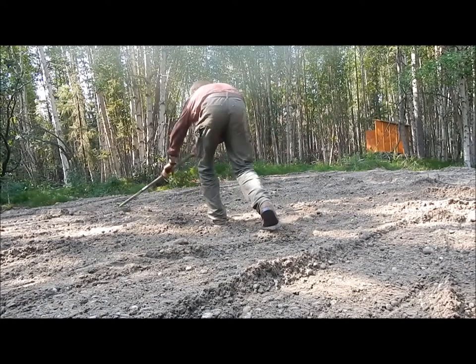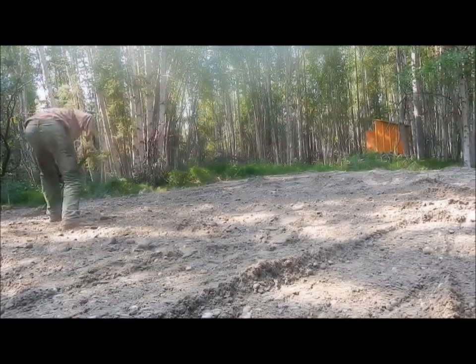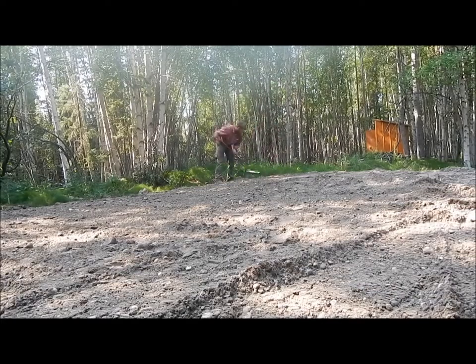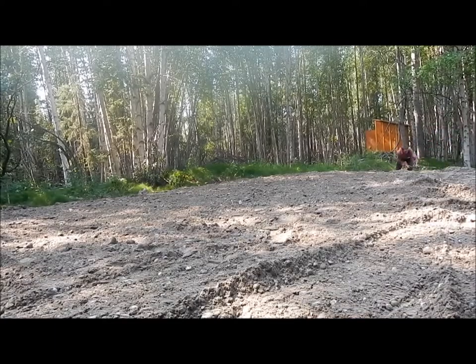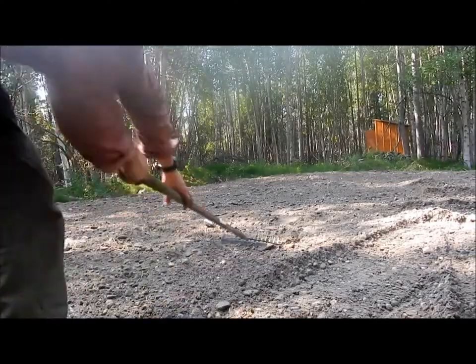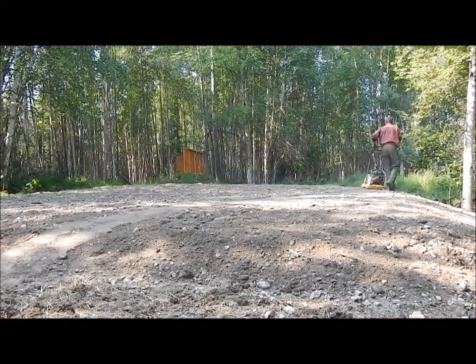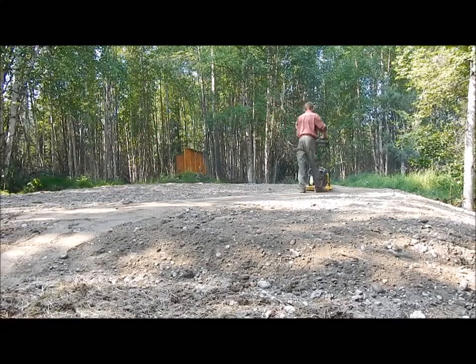Obviously we can't let the machine have all the fun — we've got to hop in there with a rake and make everything just kind of perfect before we compact it. I like to run around and get all the highs and lows evened in. I'm for the most part eyeballing this pad and each lift, but I do come out with a level and a string line to get a rough idea. It came out about two inches high on one corner and an inch and a half on the other — pretty good for not using a transit. I'll touch on transit and other leveling methods in the next video. Lots of compacting every six inches, going over it at least twice.